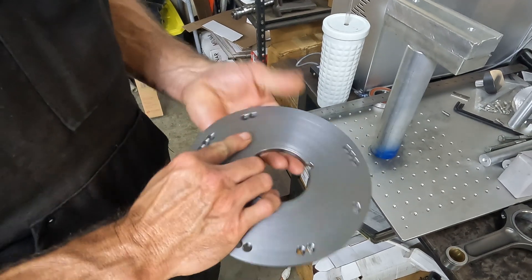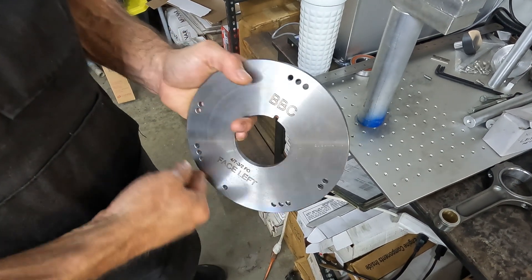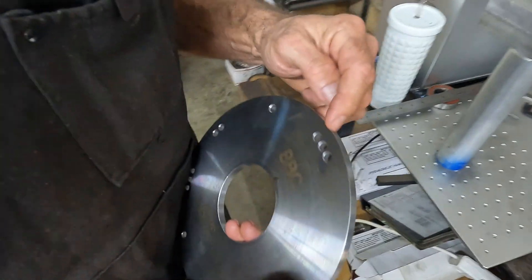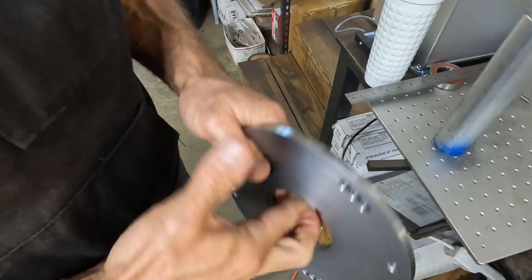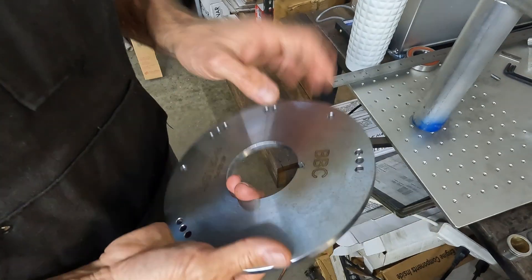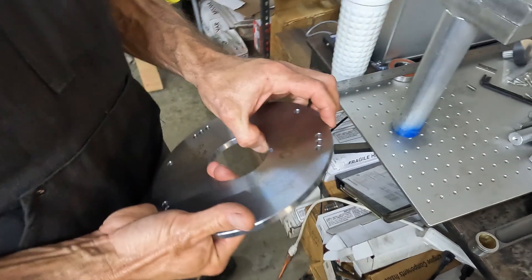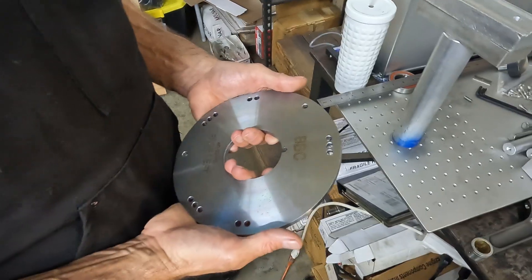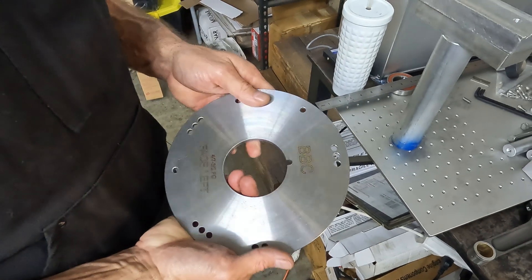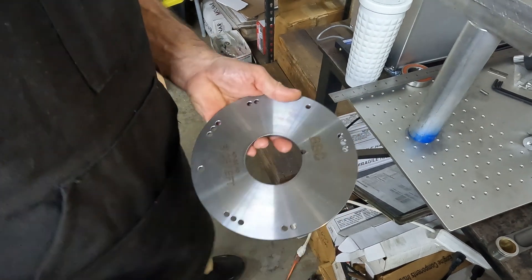All right, so there it is. It's ready for service. We still have to put the degrees around the outside — we engrave each whole degree so I can read it when I'm on the grinder — but I still have to do that. Other than that, the plate's done. We make these in-house. We have blanks laser cut out of a steel sheet, and then we bore them, turn them, and face them and all of that. Anyway, there it is. Thanks so much.